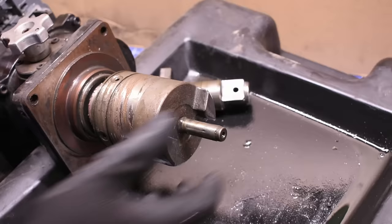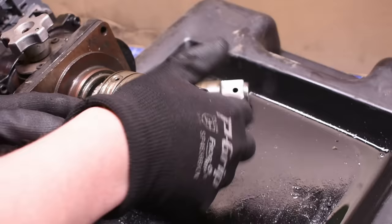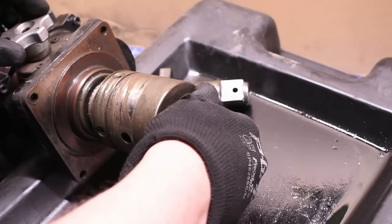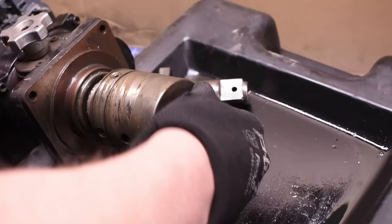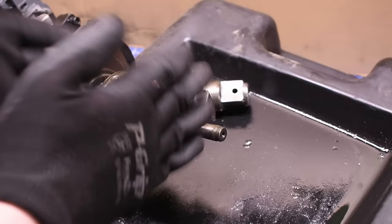Yeah, the spring is the mechanical limitation. You can only spin it so fast and hit so hard before you just max out that spring. So it's like a hollow hammer design with an internal spring, which is a bit of a waste as far as mass goes. It makes the hammer not super heavy, but it does shorten things. But it's pretty long to begin with, so I don't really see a huge advantage. I guess if you're not after like 2,000 foot-pounds, might as well consolidate it in one area.